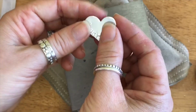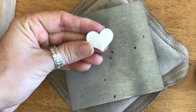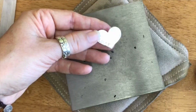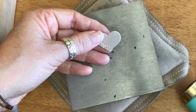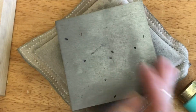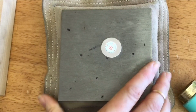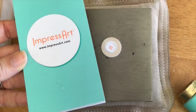And that's good timing because Maureen just asked, why do you hit it twice? Is it because of the weight of the hammer? It's just a personal preference. Sometimes I hit one time. I know Taryn, that I co-wrote the book with, hits like 3 or 4 times. It also depends what metal you're impressing into. So aluminum is pretty soft. Where I hit it twice, I've actually tapped it pretty lightly. I could have just, bam, given it one. So it's up to you and your own comfort level and your own strength also. Some people have a hard time getting an impression with just one whack. I feel like it's like double tying your shoelaces. You know the impression got in there if you did it twice. Yeah, that's true. But like you mentioned before, you could do it too hard. True, that's true.